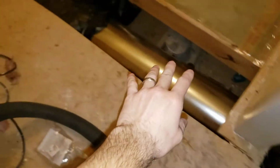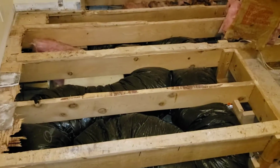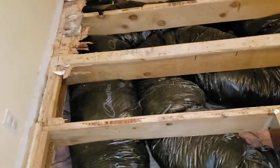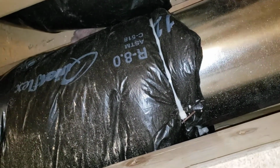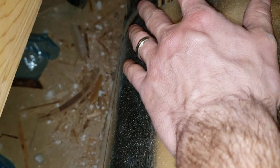And with gaps like that, of course, it's not going to be sending that air downstairs through this duct that goes here, down, over here, back over there, and down and into what we were looking at downstairs. And all of those bends, I am certain, have so much air leakage. I can't confirm specifically beyond the ones that I saw because these are in the bag with the insulation, but that's not going to hold that pressurized air flowing down.